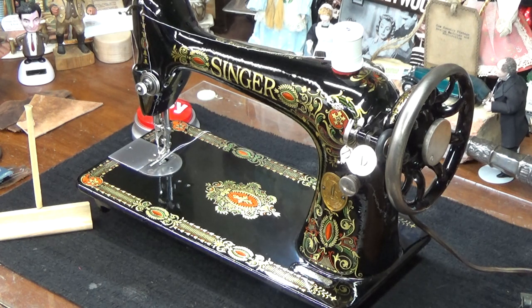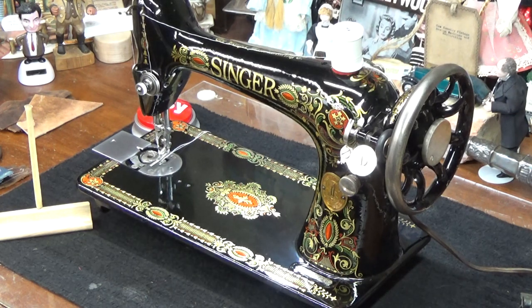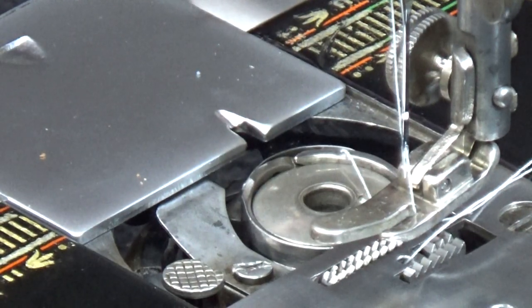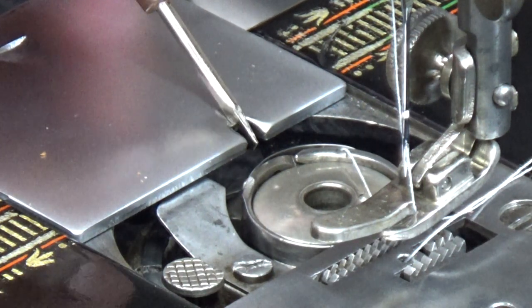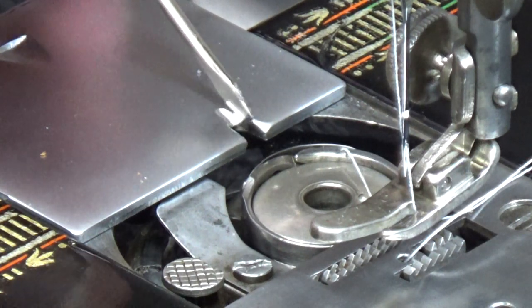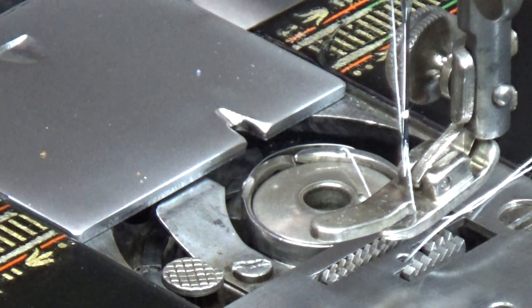All right, you guys, well, as we listen to this fun little French tune, off camera, what I'm going to do once we end this premiere is I'm going to be taking her bobbin carrier that actually has a set screw in it and an adjustment screw, and I'm going to be turning that adjustment screw in the machine, which is accessed by just opening this plate right here. And then you see this little notch. I'll kind of zoom in on that notch. That little notch is designed for a screwdriver to slide into it like this. So you can reach that screw, and in our case, we're going to be turning it clockwise so we can have a little bit more pull down from that bobbin case, okay?